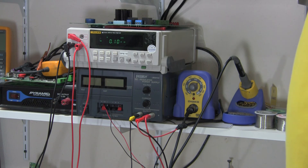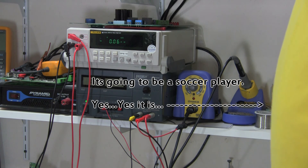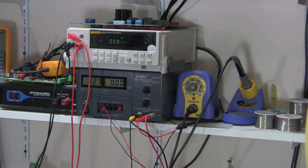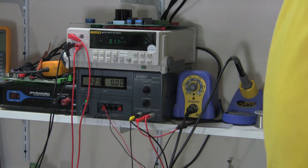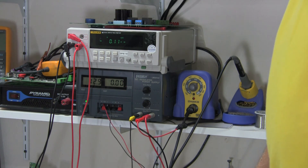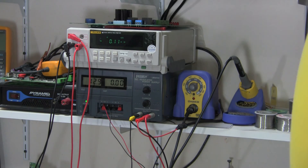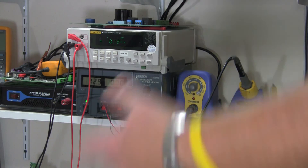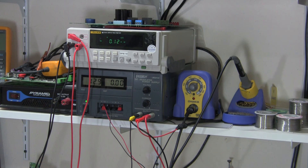I like to have a good power supply as well. This X-TEC is a 30 volt, 3 amp triple output DC power supply. I can run 12 volts up to 500 milliamps off of one output and up to 30 volts off another. So if I'm testing like a Wiegand reader and a control panel, I can have them isolated from each other and regulated, so I don't have to worry about any voltage drops.